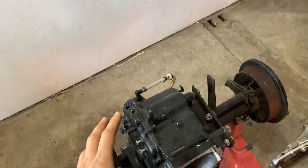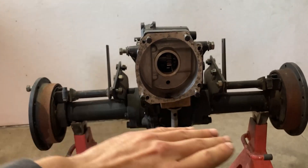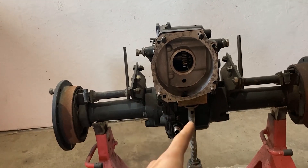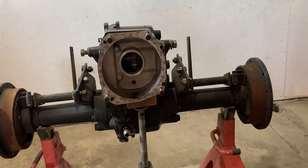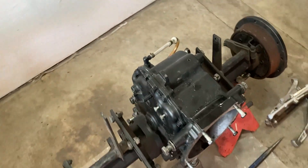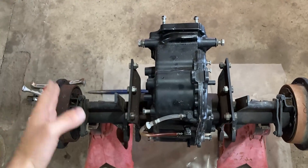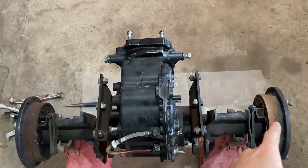This houses the transmission, which is on the top half — that is everything above the axle. The bottom half houses a bull gear that transmits power to the left axle and the right axle. Actually looking at it right now we are the other way around, but I will come to this side and share with you guys how it looks from the top. This is the left side of the machine and that is the right side — I marked it right there on the brake drum.